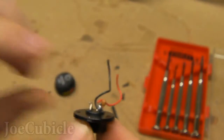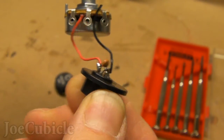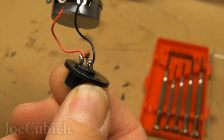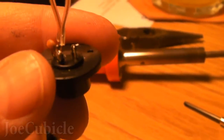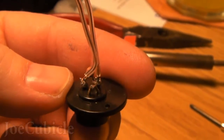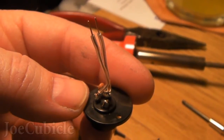If you take a good look at those wires, they're really thin — I don't even think I could have stripped them. Here you can see the bottom part of the thyristor where I've already cut the new wires, stripped the ends, and attached them to the two leads where the capacitor is bridged across. They're just about an inch and a half long — not very long. Those two pre-stripped ends sticking up are going to go on the potentiometer.